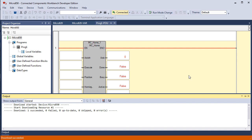When I was considering how I wanted to wire it up, because remember the LC20, I shifted the digital field device simulator inputs 0 to 5 to the actual I/O points 4 through 9. 4, 5, 6, 7, 8, and 9. Six of them. Well, with this controller, I don't need to do that because it does not have analog. So that's also something that I learned.